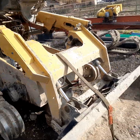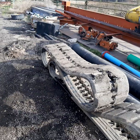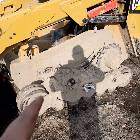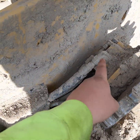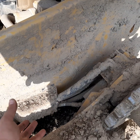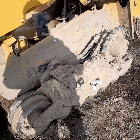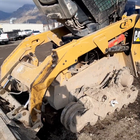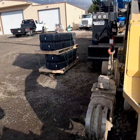This is what we've got - pretend that this machine has tracks on it. I'm actually changing the tracks, and in so doing, this track tore out and I've got some hoses that are rubbed through. I've replaced this hose right here. Where they like to rub is right here on that bracket or the cover mount - they rub through all the time. When you lose a hose, it can cause damage to your final drive if oil runs out, or even your piston pump or hydraulic pump if it gets starved for oil.